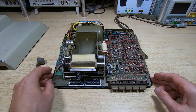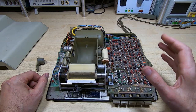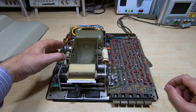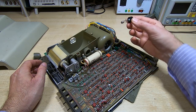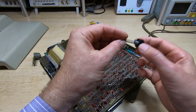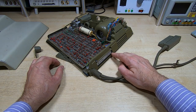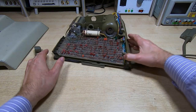So that's what's inside one of these if you've never seen one. As usual I'll be completely dismantling this, giving it a good clean, finding any parts that need replacing, doing some static testing on the board, some basic testing on the power supply, and we'll go from there to see what needs to be done. The fuse appears to be intact. One thing to bear in mind with these is this almost hidden mains voltage selection switch - you've got to make sure, especially if you're in the UK, to switch that over before you plug it in. The rest of it seems fine.